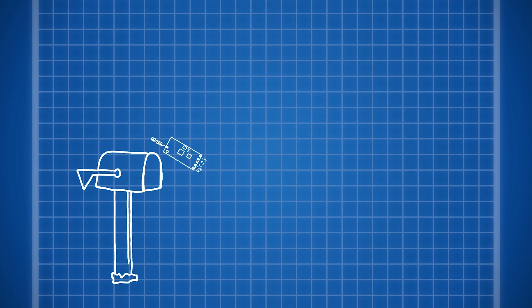The HC12 is perhaps the easiest way to transfer data over the air between two Arduinos. Just hook up the RX and the TX pins and you're ready to go. The HC12 does all the transferring and receiving for you. We use this little device for mailbox sensors, peer sensors and door sensors, so we never experienced any range problem with it since we use it for short distances.